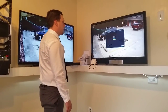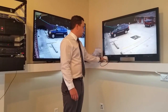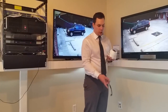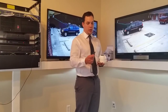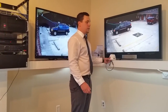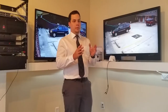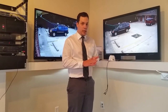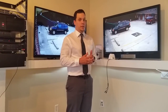That's just a breakdown of the AHD cameras. To go over what we talked about: our new AHD cameras are 720p, the same as a 720p IP camera, except they can transmit over coaxial or Ethernet with a balun. They're backwards compatible — you can change the camera from AHD to analog, and the same thing with the DVRs. The AHD system is great for people migrating from analog coaxial to AHD — you don't have to run new wires, you can still use the same 12V DC power supplies, and you can run the AHD cameras up to 300 meters.